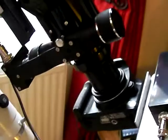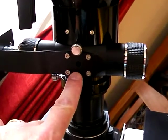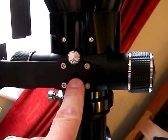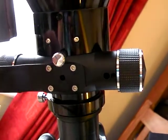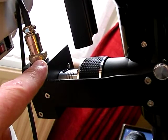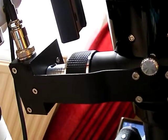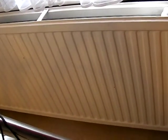Sorry, it's a bit difficult to do this while holding a video camera. There's the bracket that I made last night — it's fixed to the bottom of the Crayford focuser in the existing four positions. There's also a hole in the center so you can still adjust the drag or the clutch on the focuser. The motor is now housed in this little plastic box — it's not a project box as such; in fact the box I used was a potting box for potting boards and the like. I used that box because it doesn't have any internal posts or any internal fittings; it's just a lightweight plastic box and it's ideal for mounting the motor in.